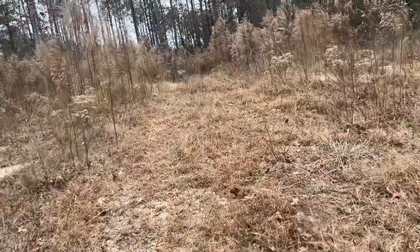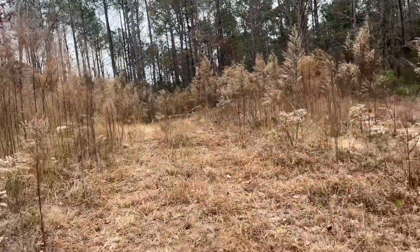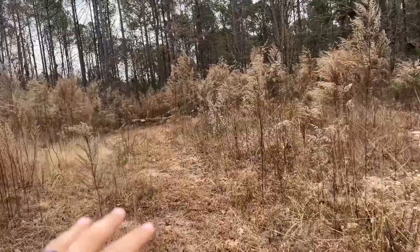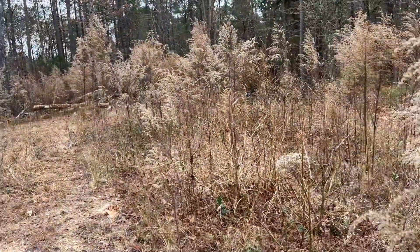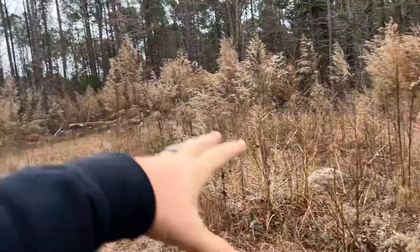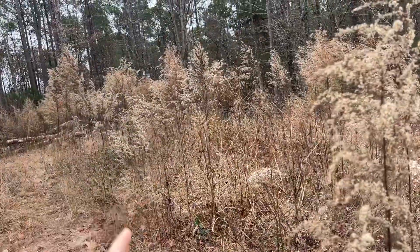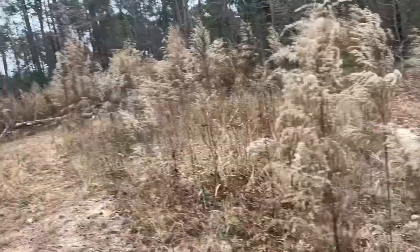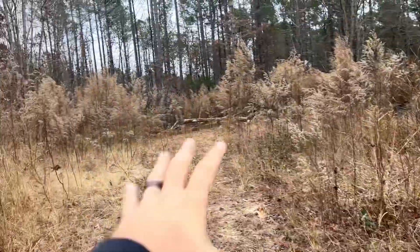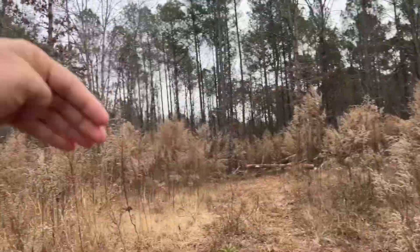Googling it, the average year-round sun here is somewhere around five to six hours — obviously less in winter and more in summer. I'm thinking I'll put a small building somewhere in this area, and I want to build everything so it can be moved later. I'll probably build it on four-by-four sleds so it can be dragged around — maybe six foot by six foot and just tall enough to walk in. I'm not putting solar panels on top of the building; I'm going to build an array on a wooden rack somewhere in this area, and that's where the solar panels will sit.